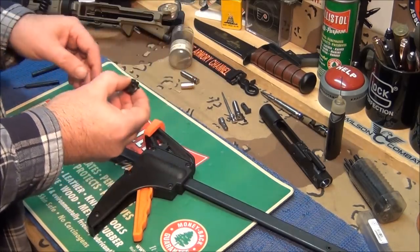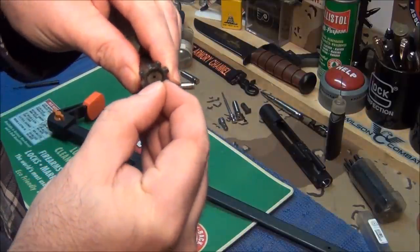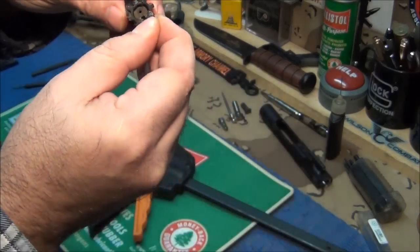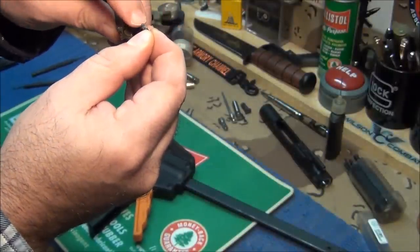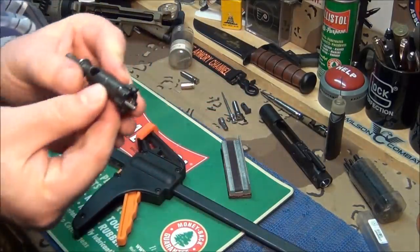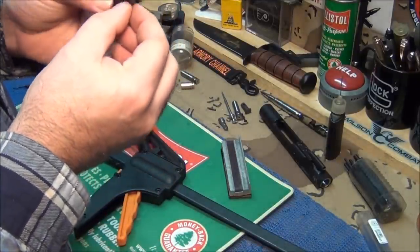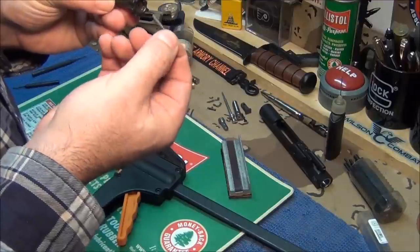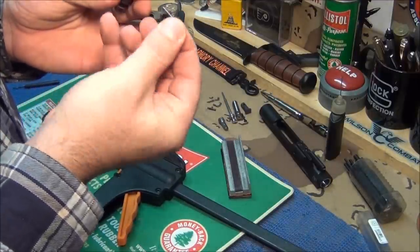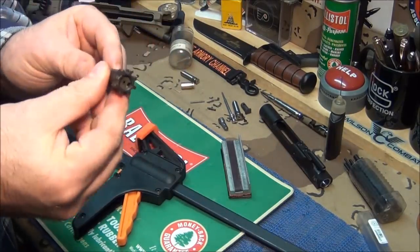Here's the ejector pin - you can see it's shaped a certain way. See how it has a cutout in it? There's a short end and a long end; the short end goes in first. There's a little spring. I never took this apart before, so let me look at the spring - make sure it's symmetrical. It's greased. Does it go in any old way? Yes, it goes in any old way. So I don't have to worry about orientation. Now my bolt is ready to be checked for headspace.